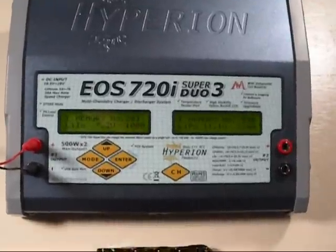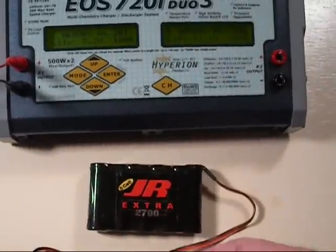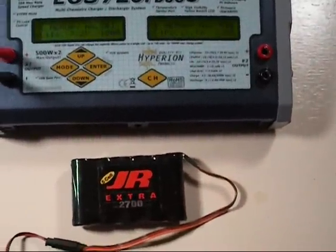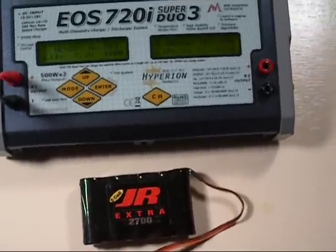It's a very nice tool. I like it a lot because it gets rid of all my conditioners, my battery cycles, and all the other stuff. What we're going to do is set out for this JR 5-cell 2700mAh pack. The reason I'm going to use a nickel metal is because for LiPos you don't cycle them all that much, and there's no way to do anything about memory or anything like that.